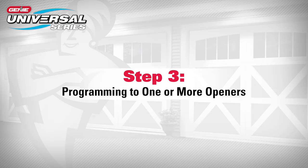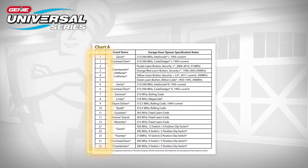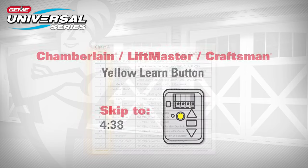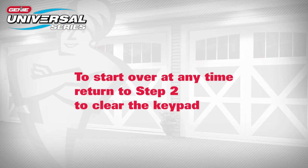Step 3. Programming to one or more openers. This keypad can be programmed to up to 3 individual garage door openers in any combination of manufacturer specifications. You must complete programming for opener 1 before programming opener numbers 2 and/or 3. You will need your opener ID number from chart A for these steps. If you have a Chamberlain, LiftMaster, or Craftsman opener with a yellow Learn Code button, please skip to the time on the screen. To start over at any time, return to step 2 to clear the keypad.